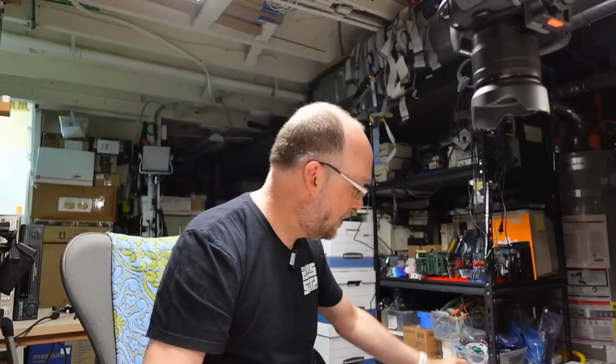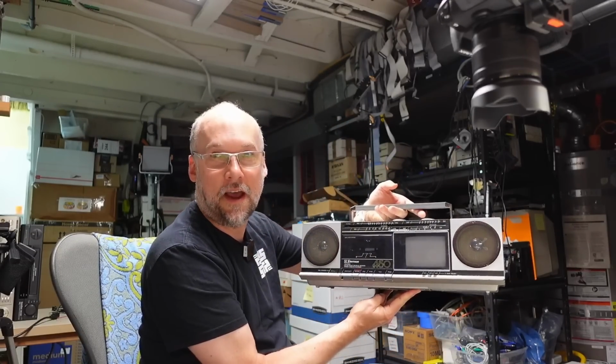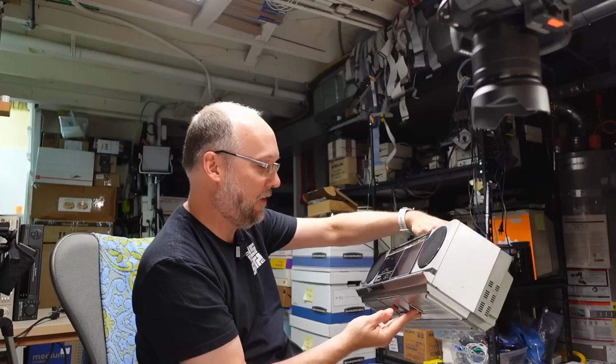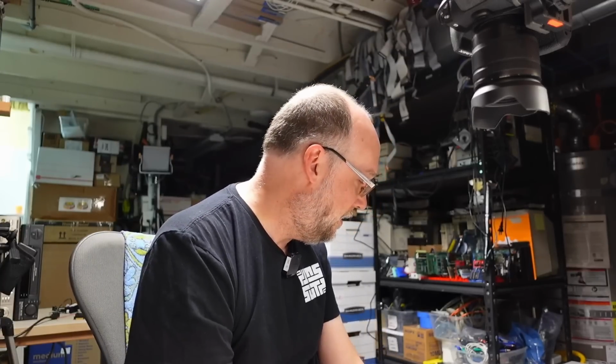Anyhow, thanks very much, Avery, for sending in these two little televisions, along with the TV stereo cassette boombox. Definitely looking for tips on trying to get this thing working. If anyone has anything, I have no idea if service manuals exist for stuff like that, Emerson and whatnot. But if it does, that would be awesome. That would really help out, actually. But anyways, I figure I can at least do some basic cleaning on that thing and try to get things working. But the fact that the cassette player is not even moving anymore, again, I guess that could be that mode switch thing that I was talking about on the other one that is probably gummed up. And cleaning and Deoxit might fix that.